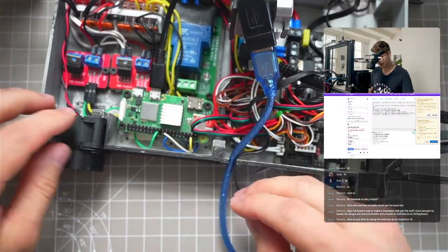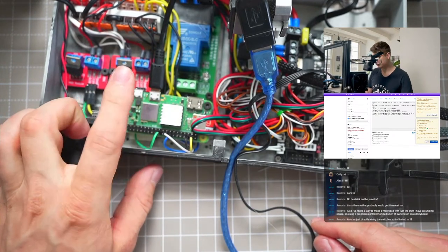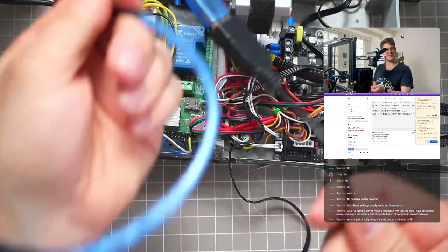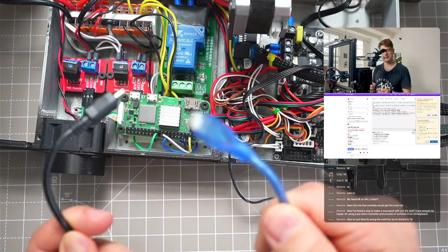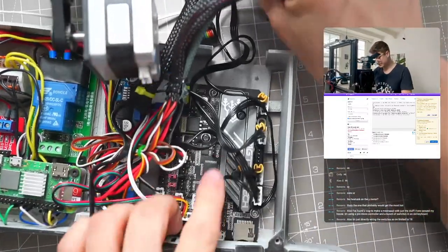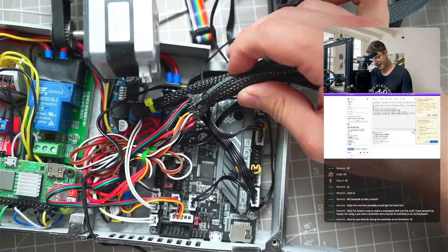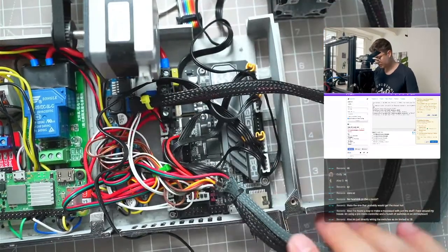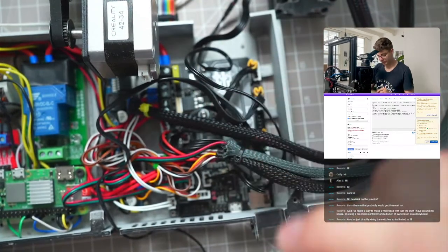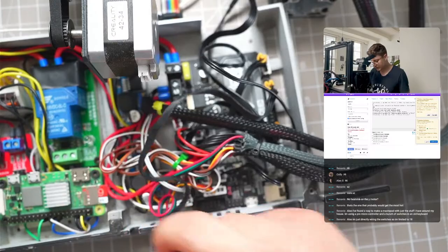We have a Raspberry Pi Zero here, a little bit elevated so all the cables are below. This one will be replaced with a Pi 4 - I can explain later why, but it's not up to the task. Then this is a super standard cable - micro USB to micro USB, which is an odd case because it comes from the Raspberry Pi Zero and goes into the SKR Mini E3. So we have the SKR Mini E3 here, which we will keep as the controller board of course. At the moment we're running Marlin here, but we will have Klipper for the Switchwire. We have the BLTouch wired. This cable is the fan on top - I'm grabbing 5 volts, so the fan was just running at 5 volts, plenty enough to cool electronics.